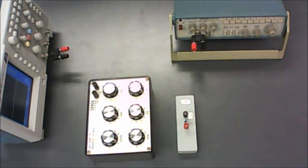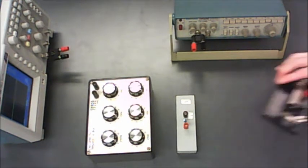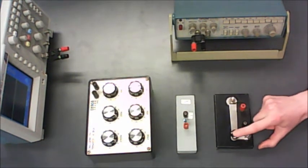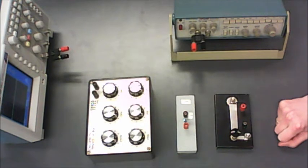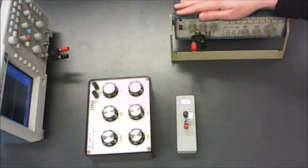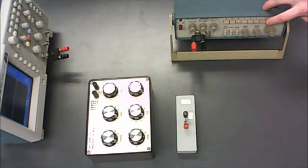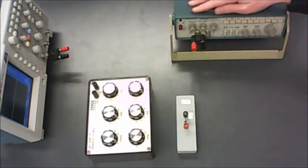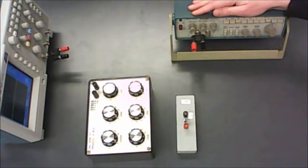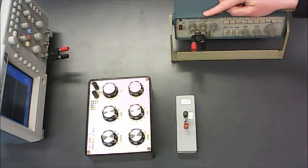In Part D, we're building an RC circuit again with the same resistance value but a much smaller capacitor. The problem is that it decays so quickly that a human controlling it with a tap key isn't fast enough. So instead of the Xantrex, we're going to use the function generator set to a square wave, adjusted so it goes between 0 volts and 12 volts — effectively, the function generator acts as our tap key, turning the voltage on and off very quickly.